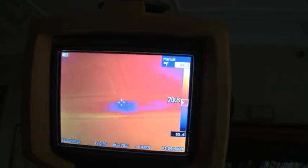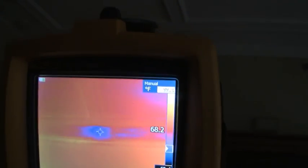Here again is another great example of using the blower door and infrared to find this area of infiltration — this tiny gap in the ceiling — and connect it up by following along to where it's connected to the outside wall. This would be almost impossible to do without the infrared and the blower door together. At least it would be a lot of work.